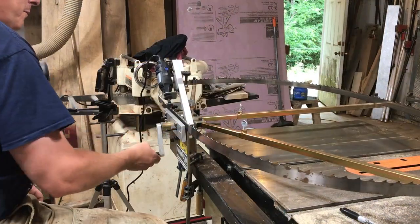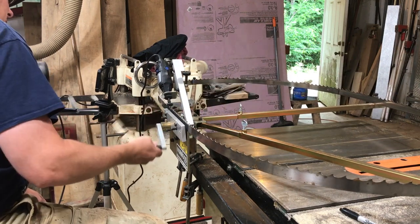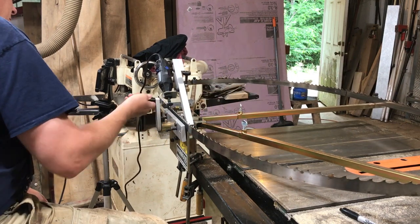What I recommend if you don't have a local sharpener is to look at learning that skill as quickly as possible. You can buy the big jigs — Norwood sent me a sharpening jig that works great; it's about $800, but it's paying for itself over time because I can just keep sharpening and sharpening. But you could also do a pretty good job with a bit more handwork, just using hand tools, taking the time to learn the skill and getting consistent in how you sharpen each tooth. Other basic supplies you need are gasoline — with my mill's 14-horsepower engine it barely uses any gas, about a five-gallon can that lasts for months.